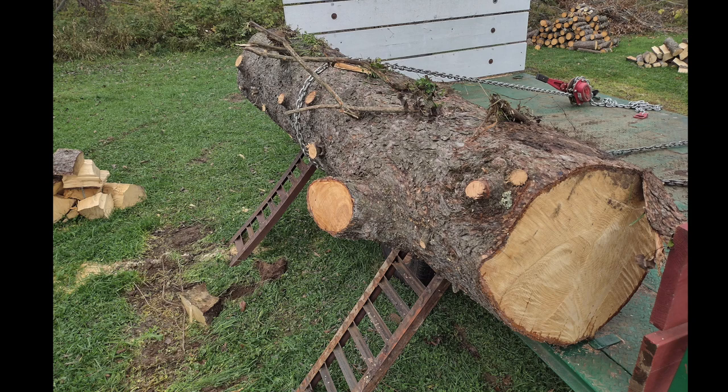And you know what? It honestly worked very well — I'm quite happy about that. The sawmill guy said this log was probably over 1,000 pounds, and like I said, that's a three-ton chain fall. I would not want to do this with any less of a chain fall, because I was huffing and puffing and cranking on that thing. It was definitely a little bit of a workout. But sure enough, the thing went right up the ramps. I was amazed at how easily it worked — very smooth. The chain fall has an insane amount of gear reduction, so it was very low effort considering the weight. I got the log from the grass — you can see it kind of killed the grass where it was laying — onto the trailer in inside of 10 minutes once I had everything gathered up.